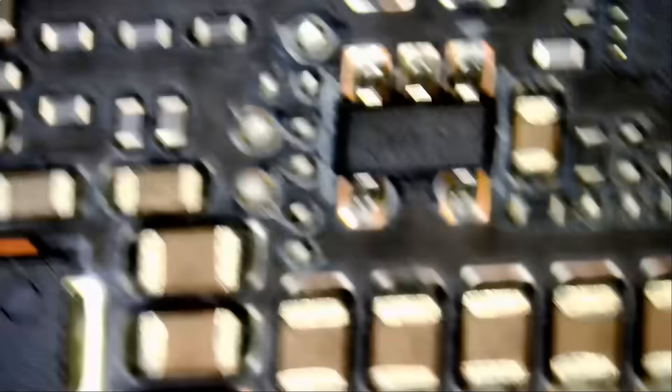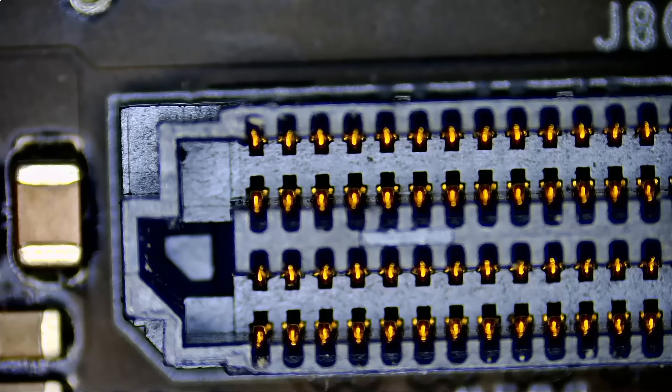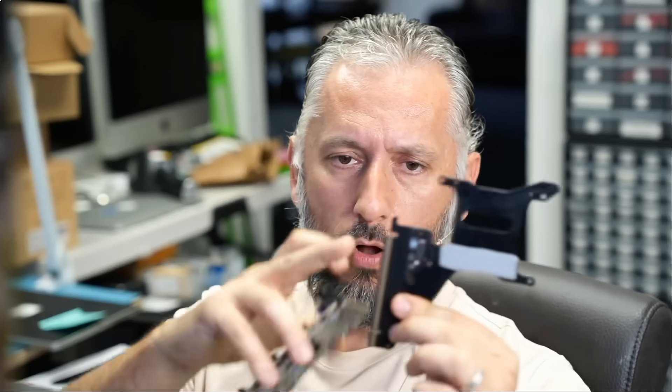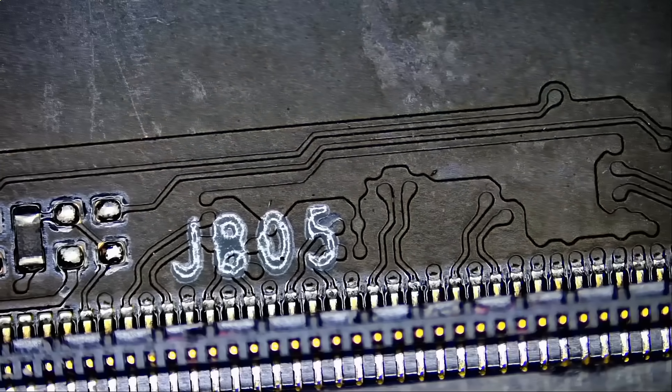I inspected the board front and back. We have one more connector with a lot of connection points — one of those points fails, the whole card will stop working. The point may be a data line, it may be a voltage line. However, you have one misaligned pin on this connector and the card will not work. Why do you want all those PCIe connector pins to depend on the pins of that connector? All those pins — 128? — they all depend on this connector.